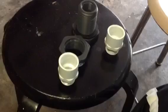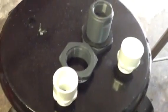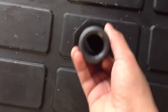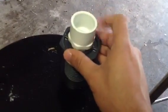I'm also going to show you the pieces of the bulkhead fitting which I'm going to attach to this tote. I have two of these totes, and this tote cost me $8 at Home Depot. The bulkhead fitting is a tad bit more expensive — this cost me almost $20. Basically, I've already drilled my hole, and this is going to fit in from the underside, coming like so. Imagine this part on the inside of the tote, coming out like so. Attached to the top of this is going to be this male adapter that you screw in. You can start to see where that matches up with this here — it's just on a bigger scale.